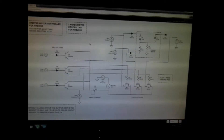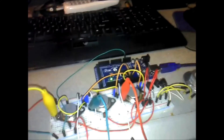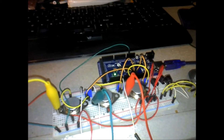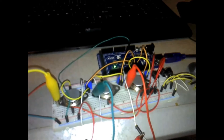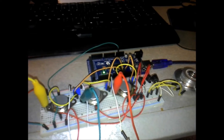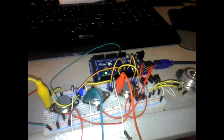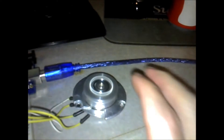I'm building my own hovercraft based on Arduino. I've been exploring the pros and cons of using a hardware versus software speed controller. I tried some example code from the internet and the motor tries to spin. Even though that code uses interrupts, I wrote my own code and made my own schematic. This one's running at about 1700 RPM — it looks slower but that's just a camera effect.